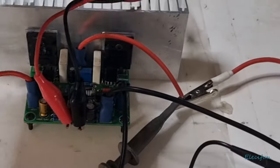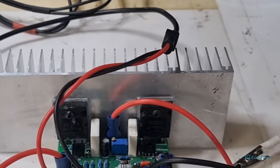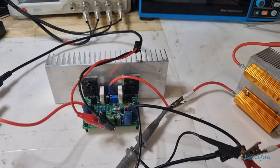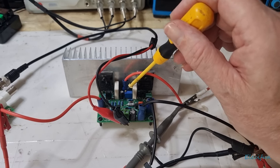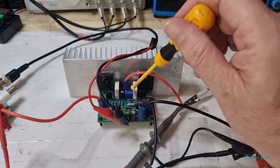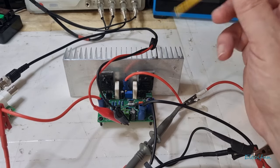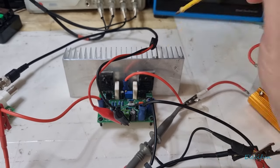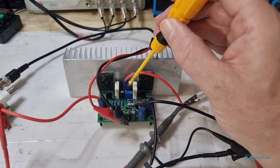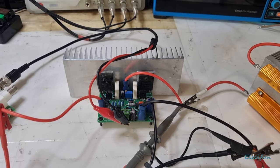Okay, that's all connected up — looks a bit of a mess, but that's how we're going to do it. You can adjust the quiescent current on here with this little variable resistor, which I quite like. On one of the other kits I built the quiescent current could rise a bit high. We can get it to where we want it once it's all warmed up and settled in — put a bit of something on there to stop it moving with variations in temperature.